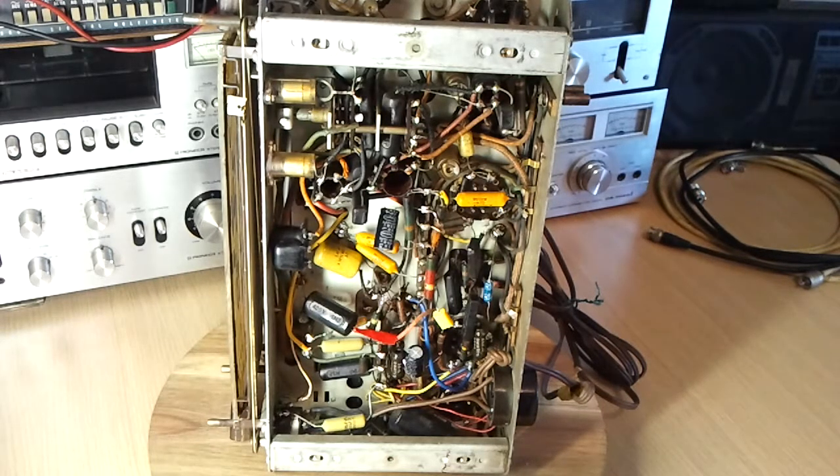There are a few resistors which have gone high, which is pretty normal. That probably won't make that much difference to the performance, at least in the audio amplifier, but I'll go and double-check their values and replace them if they're too high. There's a coupling capacitor in the audio amplifier which was causing the poor frequency response — I was saying that when I got the radio it was working but sounded quite thin and had a lot of feedback when you turned up the volume control.